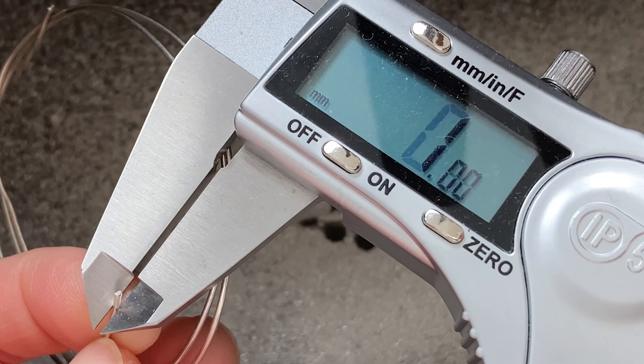Now each pin has been heated up and they are very soft — most of the pins look quite wonky at this stage. I'm going to fix that. Place the most wonky one on the bench block with the loop sticking out over the edge, put another bench block on top, and roll it backwards and forwards while pressing down at the same time. You can hear the noise becomes smoother as the pin becomes straighter. This is how it looks after that.